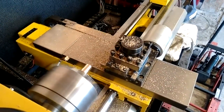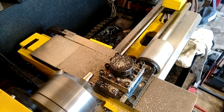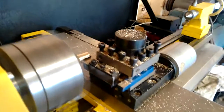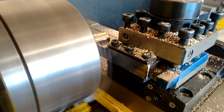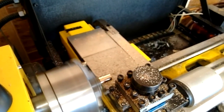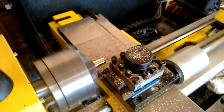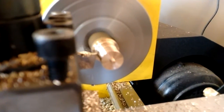Now we're doing some grooving. The grooving tool is also from Busy B — it's their parting-off blade, probably about $50. It's a high-speed steel blade in a holder. I found the height was way too high — about 130 thou above my centerline. Instead of removing 130 thou from the tool holder, which would have weakened it, I ground it off the blade itself. That let me give it a unique geometry and flatten the top.